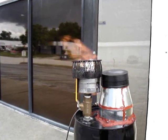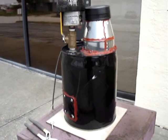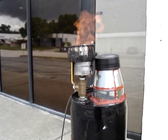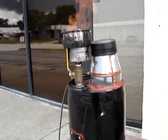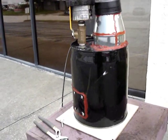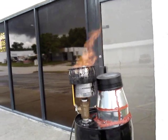It really works very well now — very little tar being produced, and it produces a huge volume of gas for a very small unit. As you can see, it's only a five-gallon drum and the inner tube is only about four and three-quarters inches in diameter. So it's a small unit but it's producing a huge volume of gas. I'm very happy about that — it's working great.